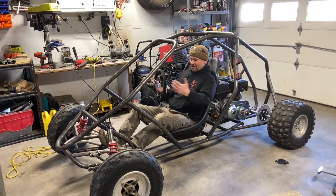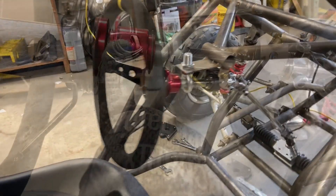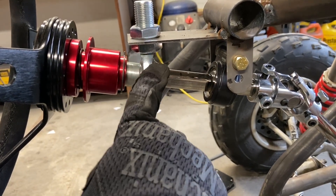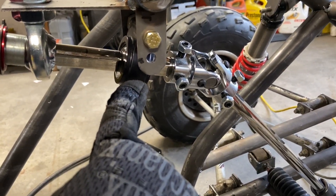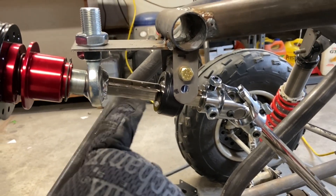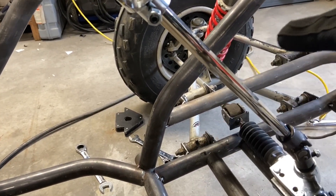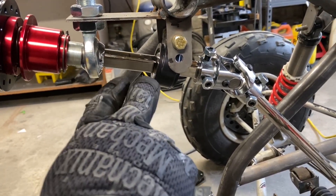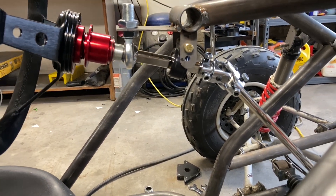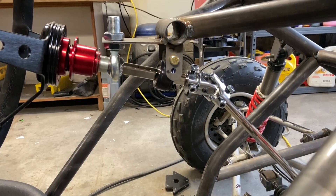Seats in — let's start mocking up this steering rack. Here's the setup: we've got our steering wheel, our quick release adapter, our three-quarter inch steering support that's adjustable, a uniball steering shaft support. The only reason I have both of these in here is because there are two U-joints. Usually one supports the shaft, but since it's all open right here, I had nowhere to put it. If you make one of these rigid, it'll take care of both universal joints. There's a better way — just get the long shaft — but for now it's working just fine.